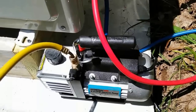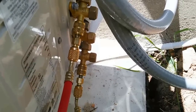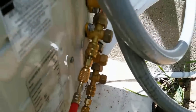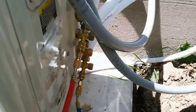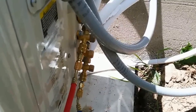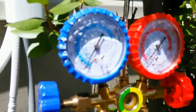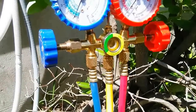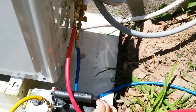The yellow line is in the center of the gauges — it's used to add refrigerant or pull vacuum. In this case I'm pulling. The red line and the blue line go on the outside of the gauges. The adapter has a valve inside like a bicycle valve, so you can take the gauges off and do whatever you want and leave those adapters on. You can see the blue line on the left and the red line on the right. I'm doing both at the same time, so I have both valves open on left and right, and the yellow line goes to the evacuation pump.